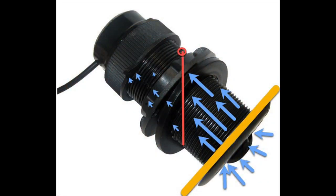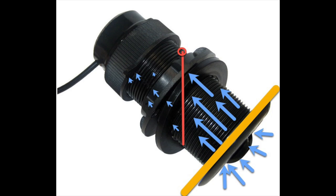The through-hull that this transducer sits in has a one-way flap — like a little stopper valve. When you pull the transducer out, that flap comes back and stops the majority of water from coming in. Some water will still get in, but there is a temporary plug you can put in place to stop the water altogether while you clean the transducer. Then when it's time to put the transducer back in, you pull the temporary plug out.